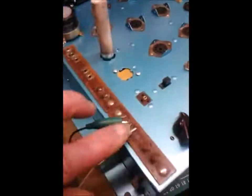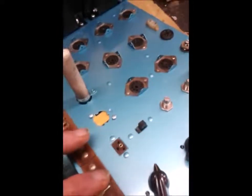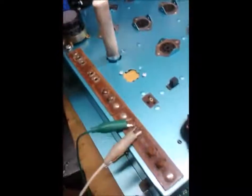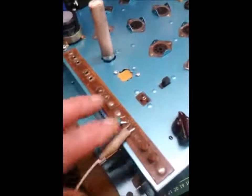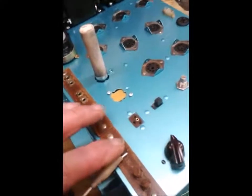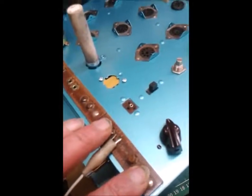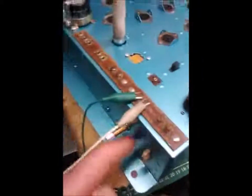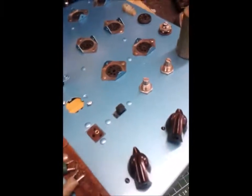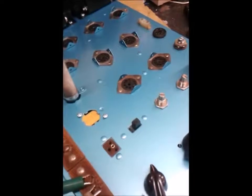What we don't want to do is power the amp up thinking you've got connection when you haven't. If you put any signal through the amplifier at all, especially at higher volumes, you risk damaging your output transformer. Always make sure you've got a good low reading - a couple of ohms - to confirm the output transformer is connected properly to your output jacks. I'm checking the stereo outputs for now until the amp is further along and tested properly, then I'll connect and check the mono output.